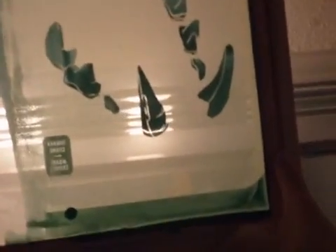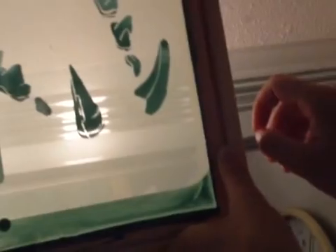Hopefully the part that got exposed — the part that didn't get exposed — is going to rinse away. It's working! So this is the stencil. The bottom part was exposed for 30 seconds and the top part was exposed for three minutes. We determined that about one minute is about the best. The very skinny clear parts are kind of bridged over — maybe we didn't wash it long enough. Up at the top, some of the blobs didn't come off at all — they're overexposed, and there's a lot of bridging of the thin painted areas.